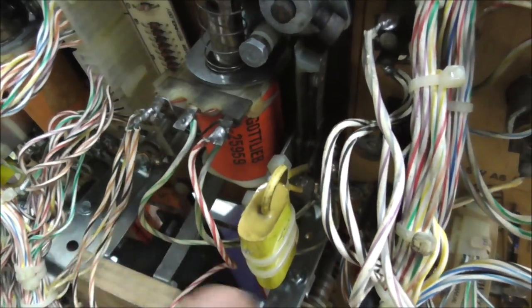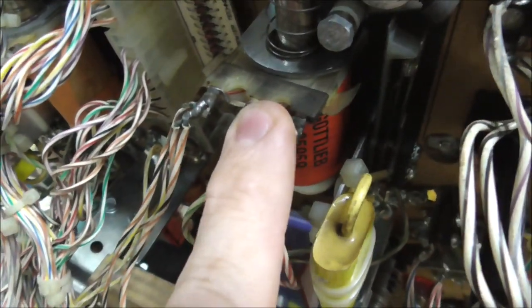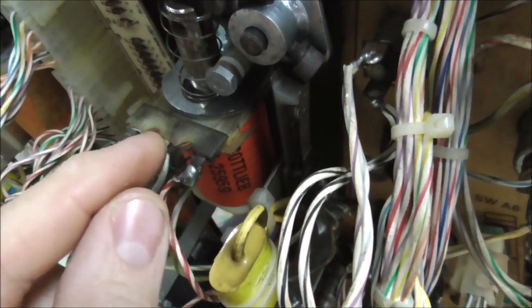The longer the winding is, the more resistance it has, and the weaker it would make a flipper, right? So by shorting these two together, you have a little short and then this winding from here to here, and that's what makes the coil pull in the plunger, right? Gives it its snappiness. And it's very powerful because it's only this winding here. It's almost a direct short, and then a little short here.